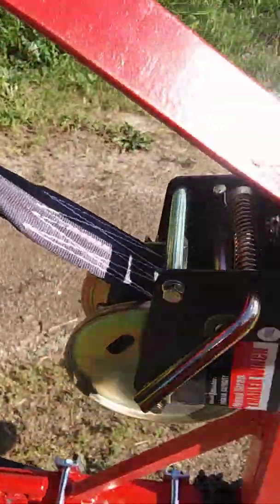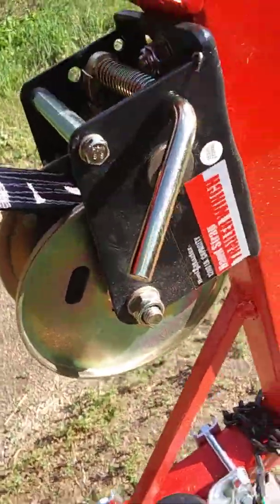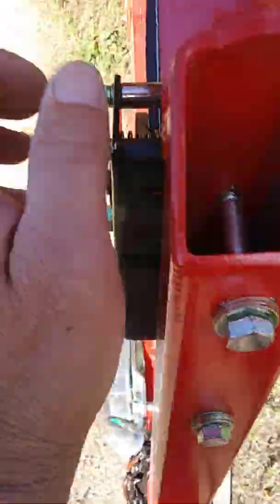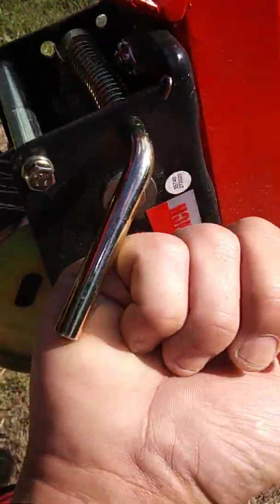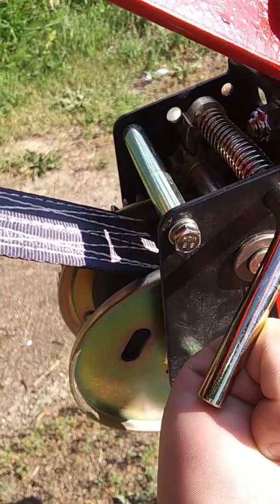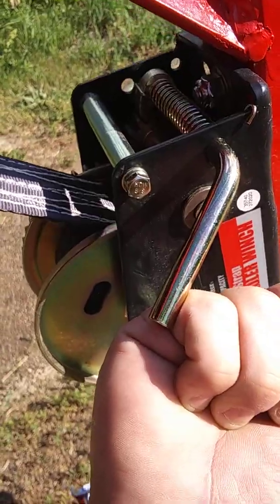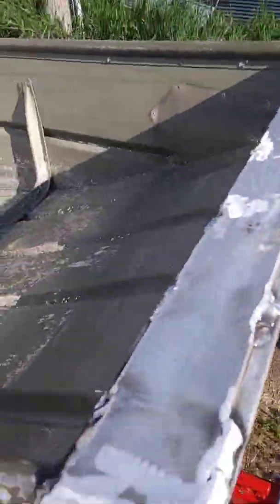Harbor Freight, I said I'm gonna send you another copy of this. It's tight okay - it's spring-loaded to release it, not to keep it locked. You'd have to put your hand on this handle, take the pressure off, and reach around somewhere to hold it. You bump this handle, it automatically releases and everything comes crashing on your little kid's head or your grandson's head - busts you up or them up. Watch that handle - and that's when it's sitting still with no weight on it.